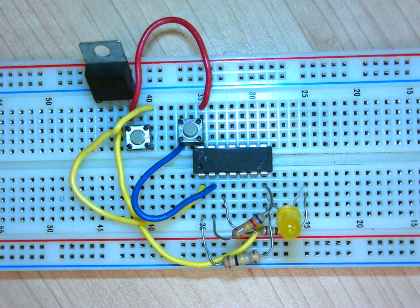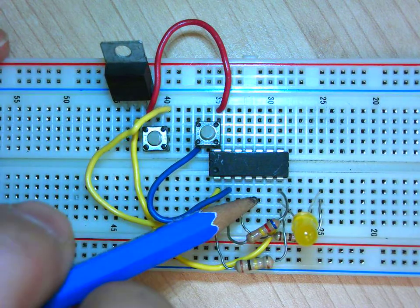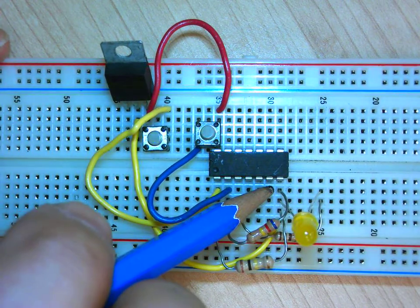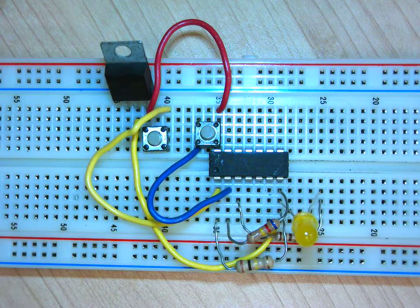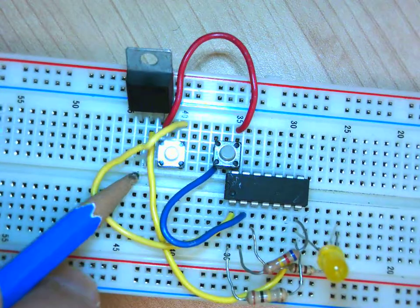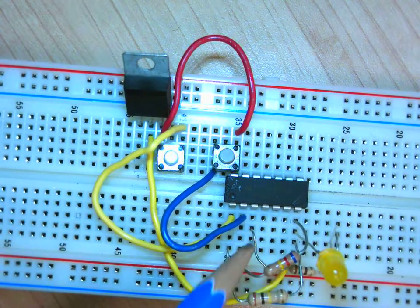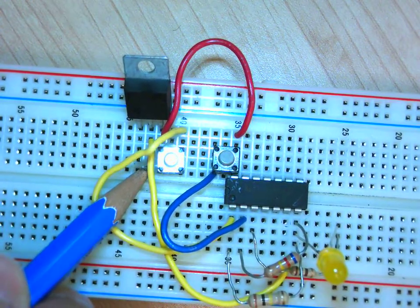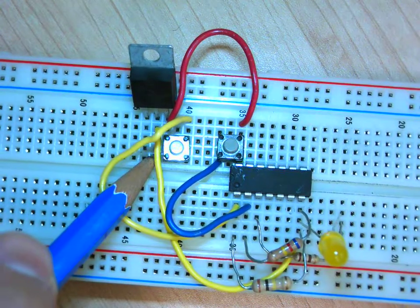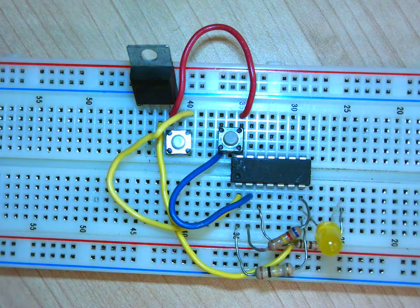No, but I need you to understand, is that the only way I could have wired that? Is that the only place I have a ground, pin 7? Hello, is it? No, where else could I have gone? Well, how about, I could have gone right here directly to the 05, could have gone to pin 2. Does that make sense? I could have taken my resistors, and instead of going here, I could have gone to pin 2 here. Because that's still a ground. Is that making sense?